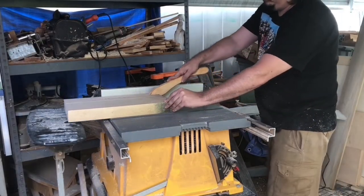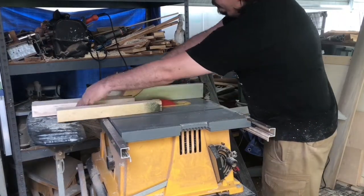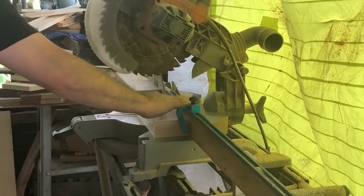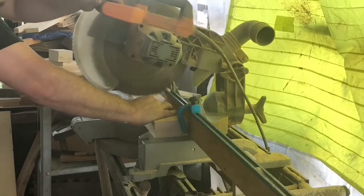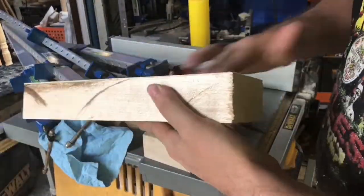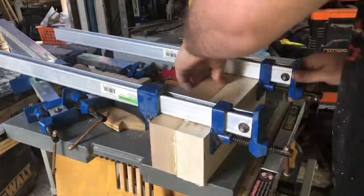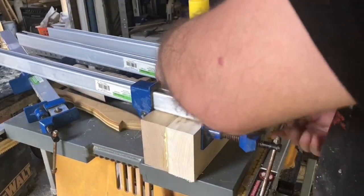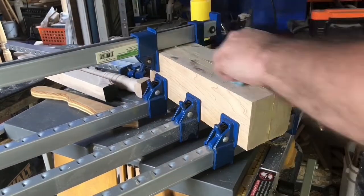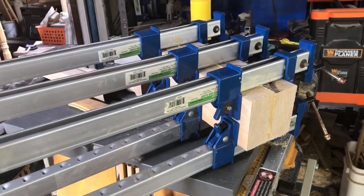I had this big hunk of maple, so I ripped off two pieces that were as wide as twice the thickness, so that it would be square when I glued them together. There was some really bad checking in it, so I cut that out and made them both the same size. Then I glued them together and used way too much glue. I should have taken the time to plane these and make sure it was a nice joint, but I kind of wasn't expecting it to turn out so well. The glue joint is easily seen and probably the biggest disappointment of the build. So don't do things expecting it to fail — set yourself up for success.